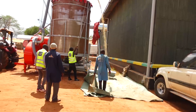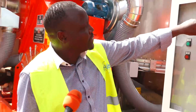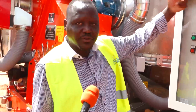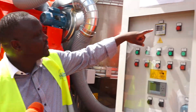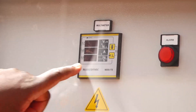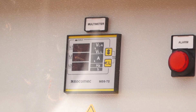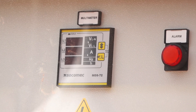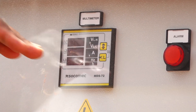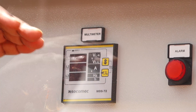Let's go back to the control panel and I'll show you how we operate it. When we start the machine with the tractor, one of the things we look for here is the power — that's the voltage. We make sure it's normal 415 volts. This is the amps, which you don't worry about too much. The most important is the frequency — the hertz. We need that to be around 50 hertz, which is the normal power frequency for typical consumption of this nature. We make sure the tractor keeps the revs to maintain that 50 hertz.